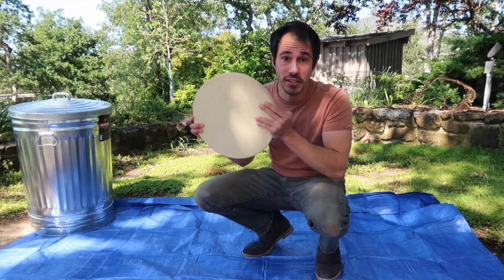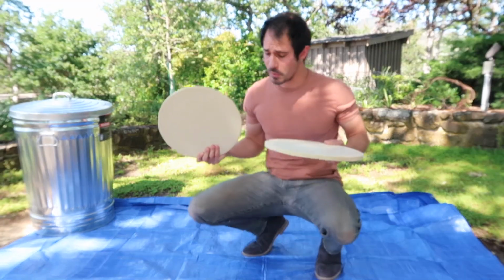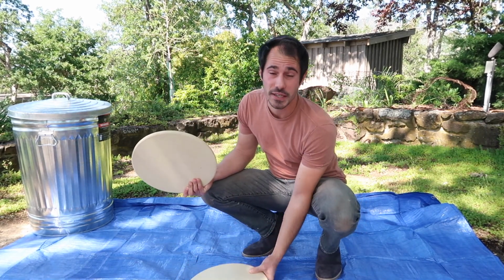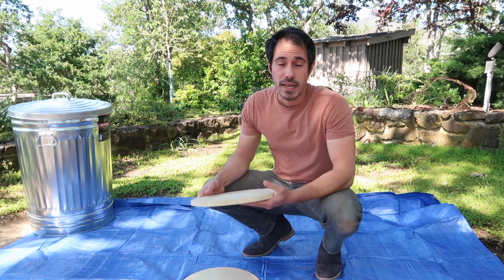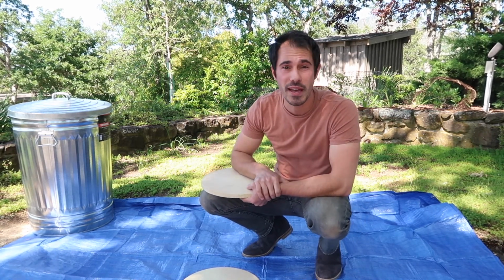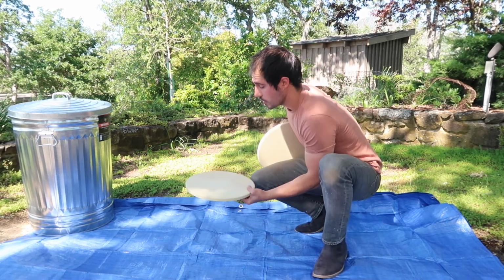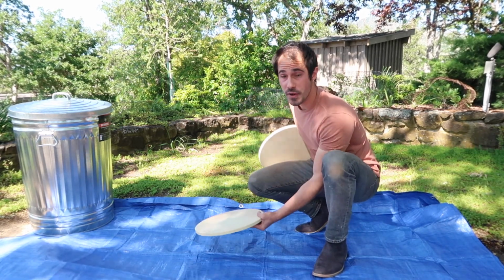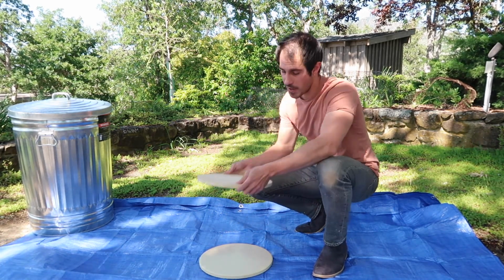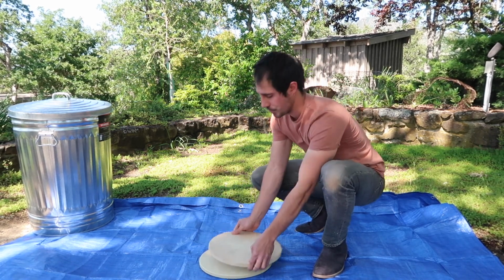Next up, I got some kiln shelves. I have two shelves here because when I'm going to be layering inside, I'm going to be having insulating fiber to hold the heat, and I'm going to have one patch on the ground, and if you put a pot directly on that, it's going to be a little bit unsteady. So putting one shelf on the very bottom, we'll be able to stack the furniture on there and then put the pieces on the shelf above it just for more stability.